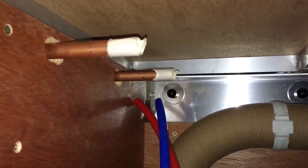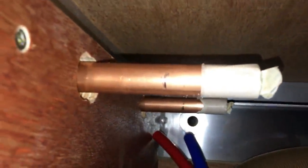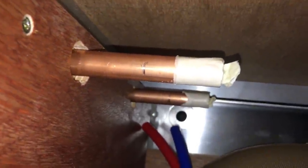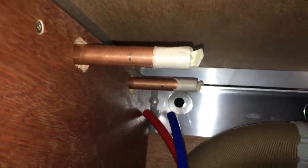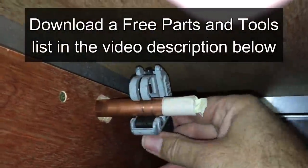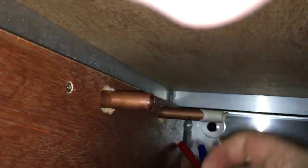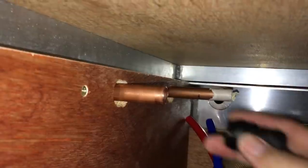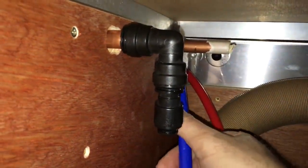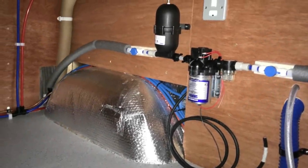Here are those two tails sticking through from the shower mixer into the garage — these are the two pipes that we need to connect the hot and cold to. I've marked them at 35mm from the board and I'm just going to cut them back a little bit — that gives me enough to push into the fitting with a little bit of spare. I'll cut these to length, push that 15mm elbow on there, and then cut short and push it into the end of that 12mm fitting. That completes the installation of the hot and cold water services to the shower — it just remains now to test everything.